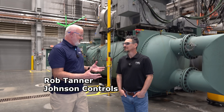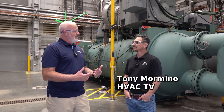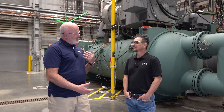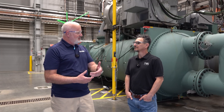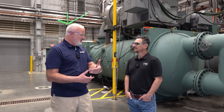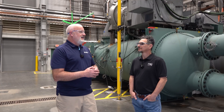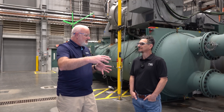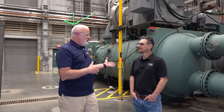This is a compressor we refer to as our R8 compressor - a centrifugal compressor built for our YK product line to recover capacity we lost when we moved from R-134a to R-1234ze refrigerant. That was as much as 25 percent capacity loss, as we discussed transparently.